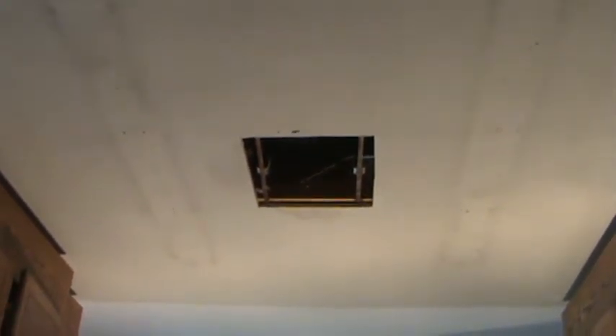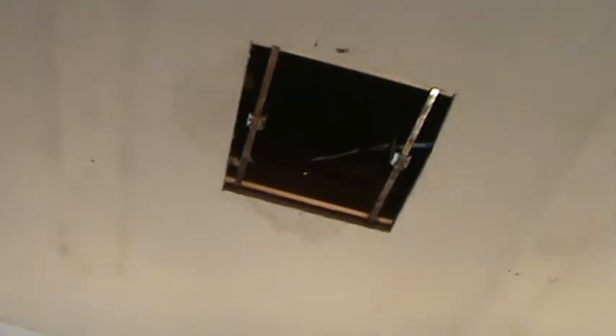Now that I'm back down from the attic, there's a couple more things I did. I loosened up the wires and I've got an idea of where and how I'm gonna hook up the main wire to all these light fixtures. Right through this area there's blown insulation — I crawled in there and moved it away from where the next light fixture is gonna go, my cut-in box. I moved the insulation away over here too, and then from this one I'm gonna go about 16 inches over and put another one just beyond that.